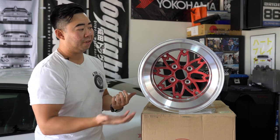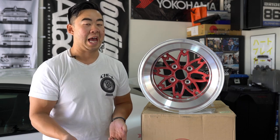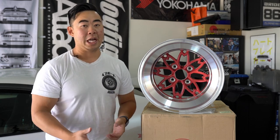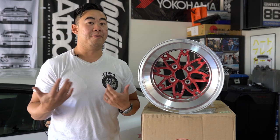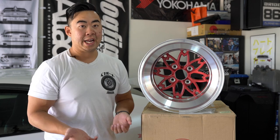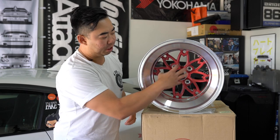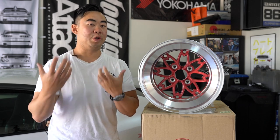The wheel is available in two sizes: 14 and 15 inch. The 14-inch was the original, made of aluminum using a sand cast method — and still made that way today. New ones are being made exactly the same as the old ones, in very small batches. They told me they could only make four to five wheels a day using sand casting. The 15-inch introduced die casting, allowing production of upwards of 50 wheels per day, and these wheels also go through heat treating, painting, and machining, which is why we're seeing a resurgence on the market.